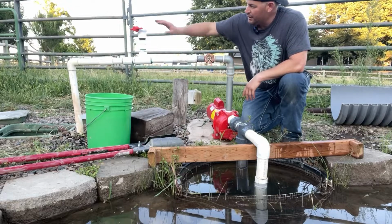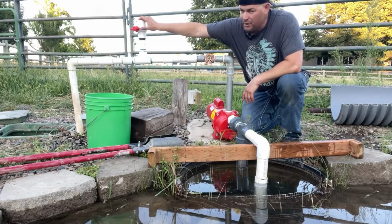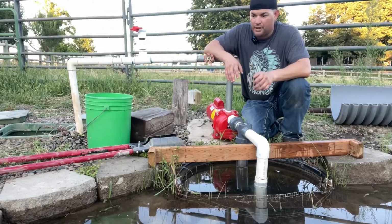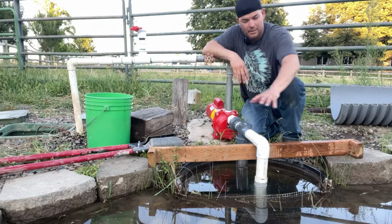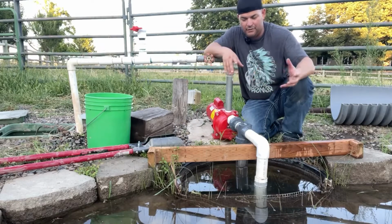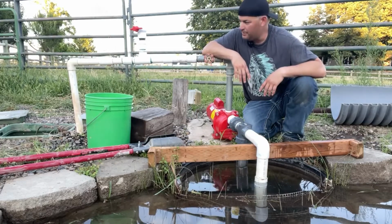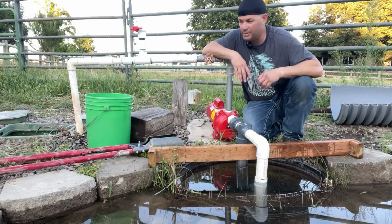As the water comes in here, this is where I prime it. I have a PVC ball valve here, and from here I can prime it, check things out, and get that water onward to the valves. Each valve I took apart and used a screwdriver, my thumb, etc., and scraped off all the silt from each individual valve. The valves were covered in silt. Again, I dug about 800 pounds of silt out of this ditch to clean it up. I put new snake fence in here in efforts of filtering the water before it gets to the intake. And I used some wood here because this PVC pipe with the pre-filter does get a little heavy as the water comes in. From there, this water is going through the valves and into Rainbird 35A sprinkler heads, and I'll show you that in a second.